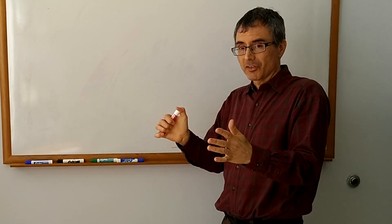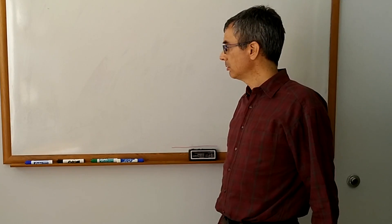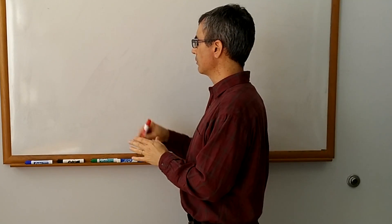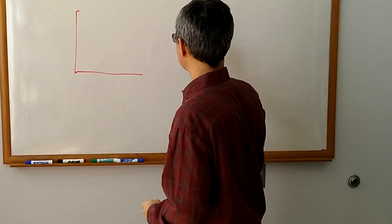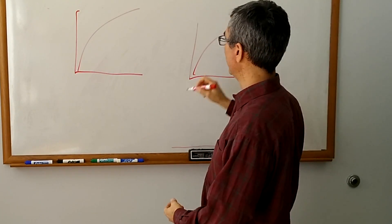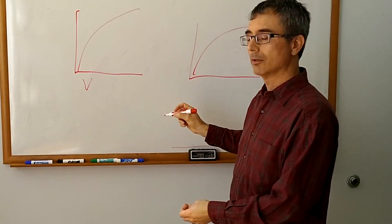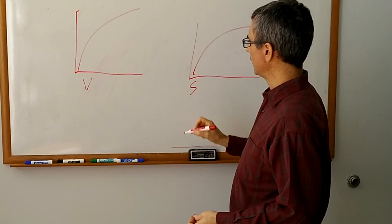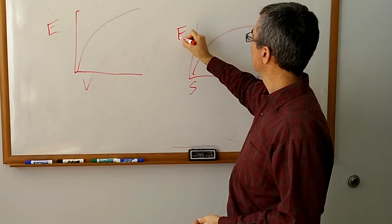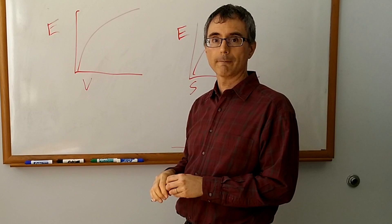Efficiency curves, voltage, power input — what's the upshot? If you've got efficiency curves, they are steep at low values of voltage and low values of speed. So I know I'm falling off the steep end of both of those things. The open circuit voltage gives you the upper limit of the possible voltages you could use.